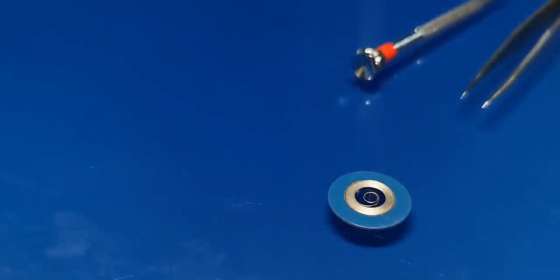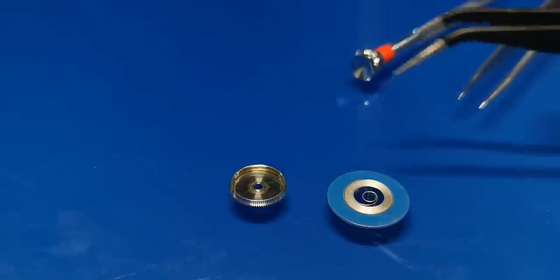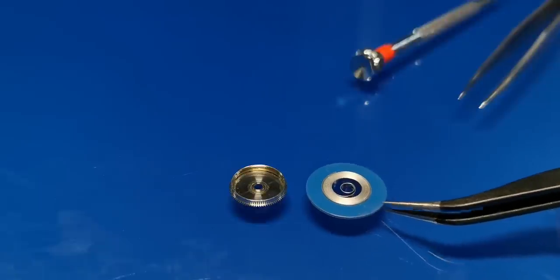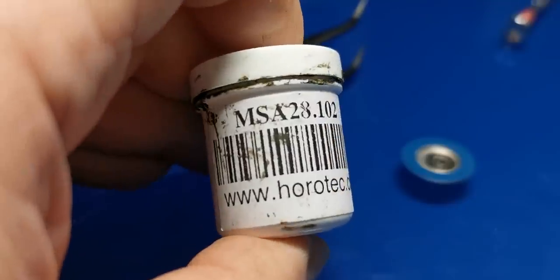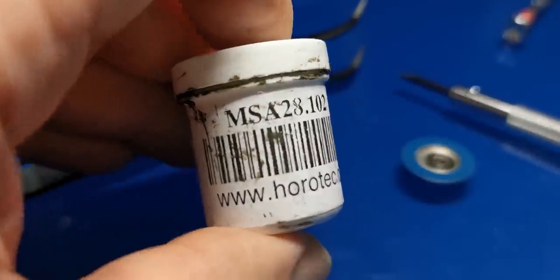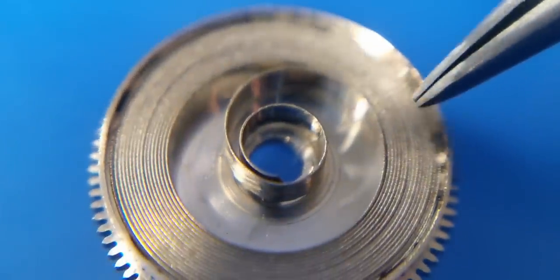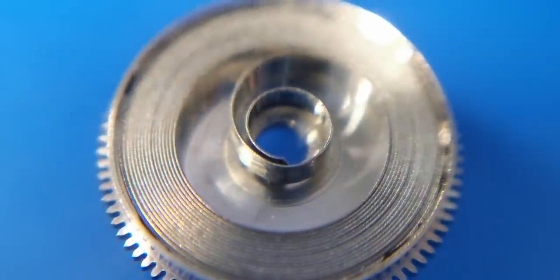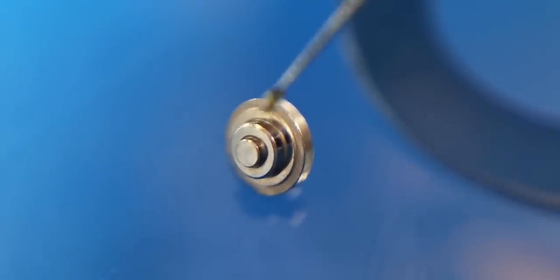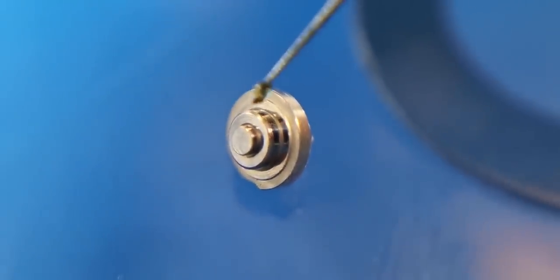You need to be careful when you do this. There is the clean barrel, and the key thing is to get the spring in the right way round. This is braking grease, and you need to put a small amount on the inner edge of the barrel before you put the spring in. Coming in close to show the lubrication of the barrel arbor before putting it back in.